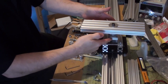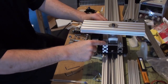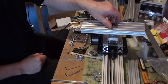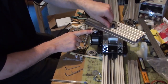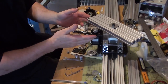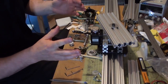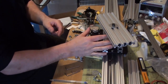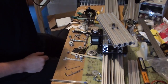So, this is now bolted to the flange. Flange is bolted to the Perspex plate. Perspex plate is now bolted to the framework, and it does turn beautifully. And there's clearance over the cog. And now I've got to put the belt on from here to here. When I get the new belt it will just slip over, hopefully, fingers crossed. If I've got to move it, I've got to move it. But the new belt should fit this perfectly. I might have to put an extra wheel on to tension it, but that's not a problem.